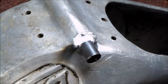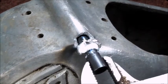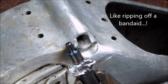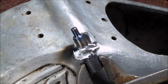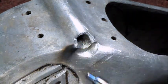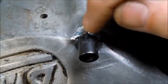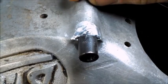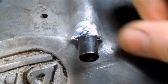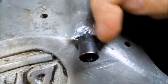I'm going to see if I can get that pin out while it's cooling. Well, that didn't stick. Looks like it might have tried to stick right there. After I pulled that first batch off, I did the exact same thing again and was a bit more patient letting the base metal actually melt the rod. It's stuck now and I've just done a little bit of filing work in preparation for another batch to build it up.